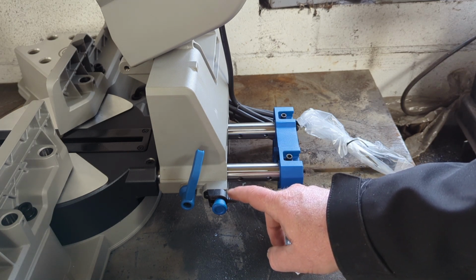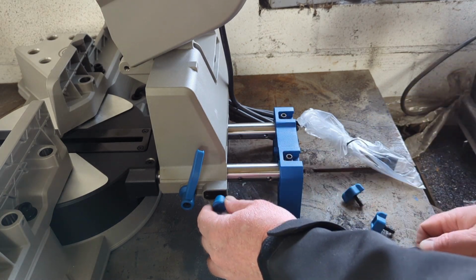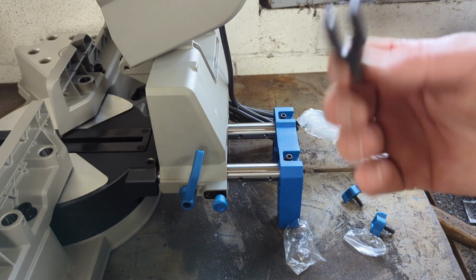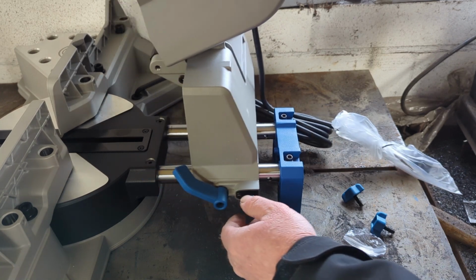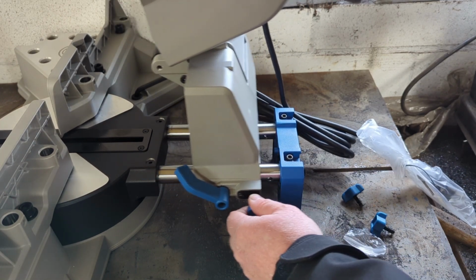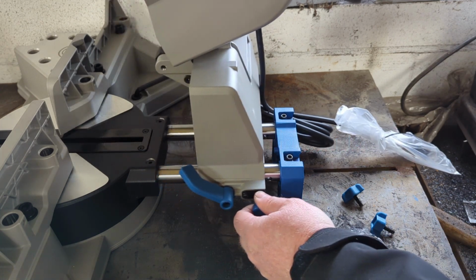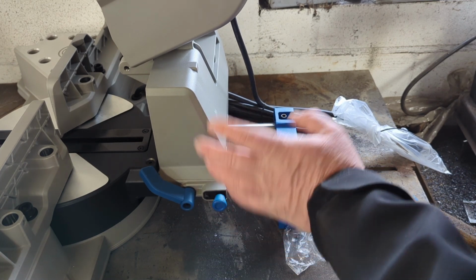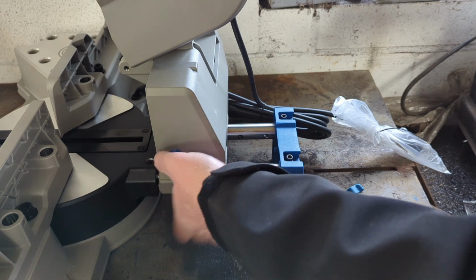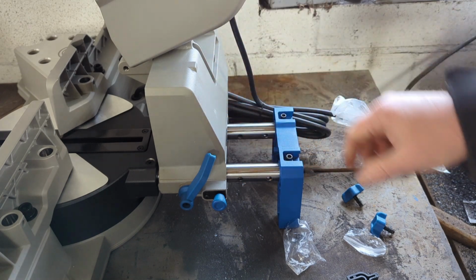Another thing that the directions say is this little black clip right here. It's keeping this plunger from being depressed. So you want to pull that out, and what that allows, release that, and that allows the piece to slide to 3 different settings depending on what kind of cut you're making. Now, it says in the video, this isn't like a sliding chop saw where this is made to slide while you're working with the saw. You get it to where you want it. You lock this plunger in, lock the handle in, and that's how you cut. You don't let this slide while you're trying to cut.